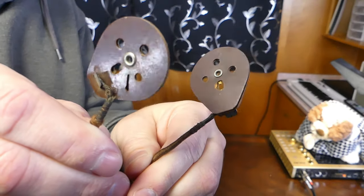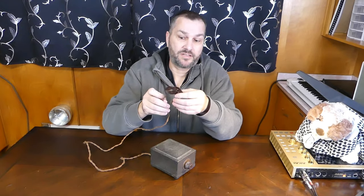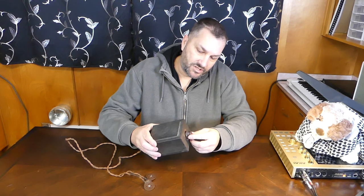This has a couple little paddles on it. These would have sandwiched underneath the vacuum tubes on that tube amplifier and interacted with the signal in some way. In terms of analog tone controls, there are a lot of different ways to do this using passive components. Most of them involve some network of resistors, capacitors, and potentiometers. The capacitor is a reactive electronic device that responds to frequency, the resistors stabilize that, and the potentiometer controls exactly where you are on that scale. This may be a single potentiometer or two mounted on the same axis — we'll find out.